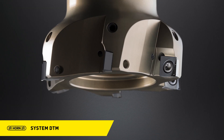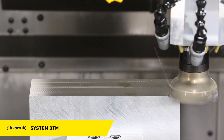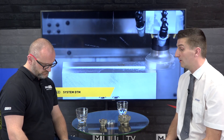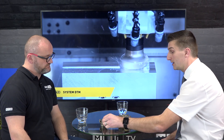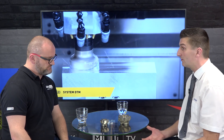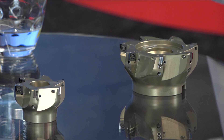If we look at the video, the insert has quite a unique chip breaker, which for a diamond insert is fairly unique. Yeah, we've got a reduction of up to 70% on the swarf volume with the chip breaker inserts, so obviously you keep your swarf bins full of swarf and aren't emptying the machine or the swarf bins as often — increasing your productivity.